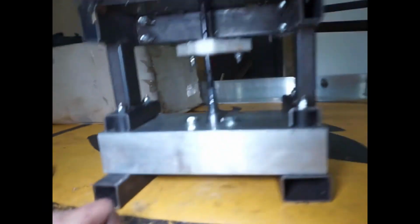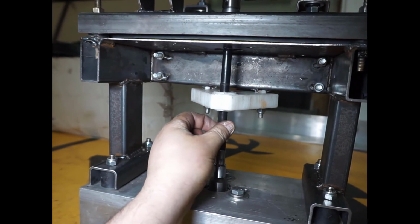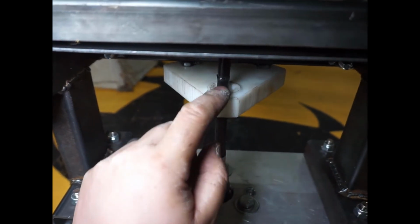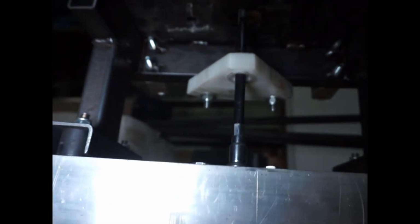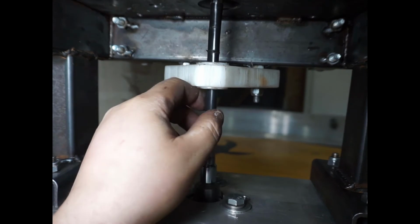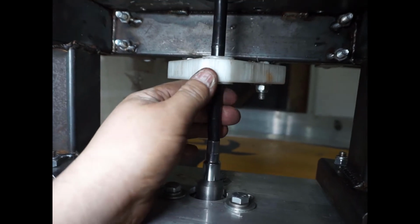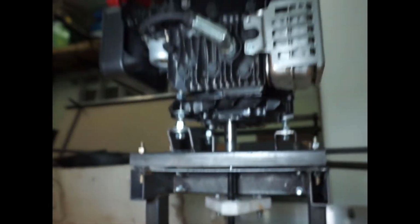So another thing that I noticed is that when I had it on high speed, the flexible shaft, because it was spinning so fast, it actually bent out all the way around. So what I did is I took a piece of Teflon that I had lying around and drilled a hole in here and attached it with some bolts right center. Let's see if I can show you how. Right there. So this shaft here in the center is prevented from going out any further than this. So that's maybe a 1/4 inch either way. And what you'll see bending here is really just a sleeve. The inside, the actual core is going to be a lot stronger, and that's going to rub against the Teflon and should prevent it from bending too much. So I think we're going to be okay.